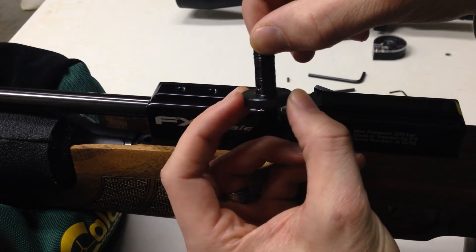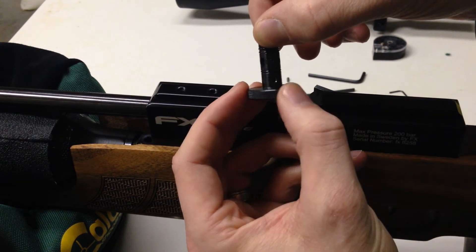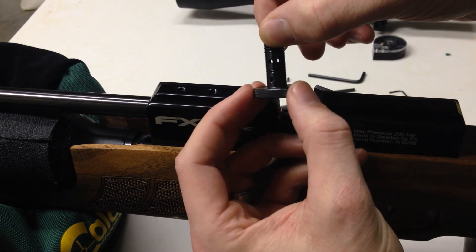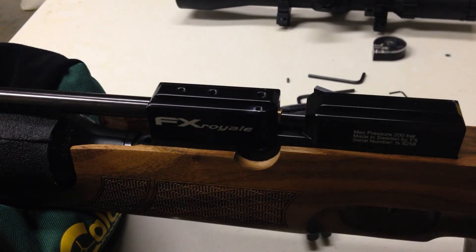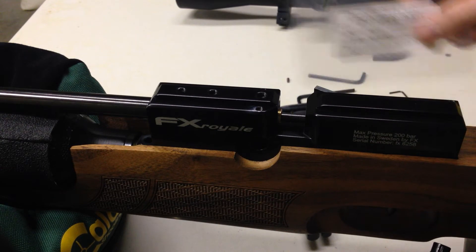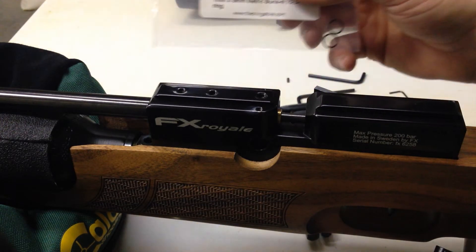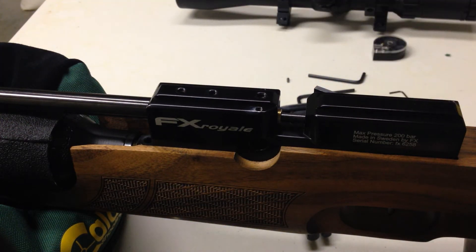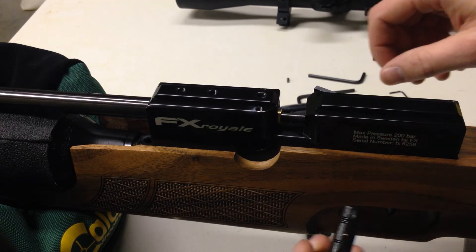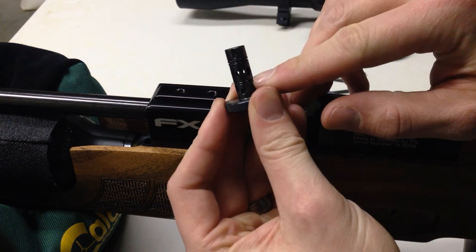You can see it adjusts the diameter of the transfer port — you've got that really small hole, a really large hole for high power, and a medium hole. I actually had one of these O-rings blow out, which caused a very quick reduction in power. I bought replacements from the O-ring store: 1mm by 8mm. It's actually not the correct hardness — it's 70 durometer Buna-N, and it's supposed to be 90, but it's the only one I could find easily. So that's the one I replaced these three O-rings with.